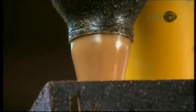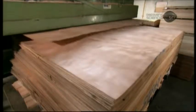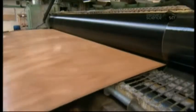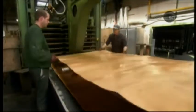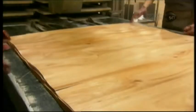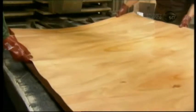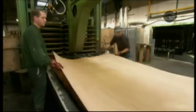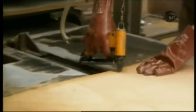This thickness of plywood has a 5-ply core. Three of the plies remain dry, while two go through a machine which rolls strong, water-resistant glue simultaneously on both sides. Assembly begins with alternating grain directions: the first ply is a dry one, the second a glued one. Its bottom sticks to the ply underneath, the top to the dry third ply above. The fourth ply is glued — its bottom sticks to the ply underneath, and the top to the fifth and final dry ply above.